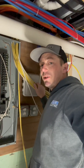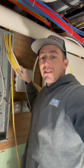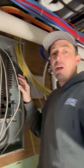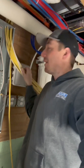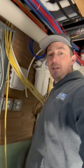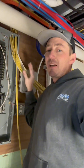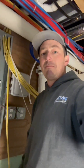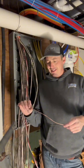Something you want to keep in mind when you're doing these panels: how your wires come into the panel also dictates how good your panel looks. If your wires coming in are all bent up and hard to deal with and not nice and smooth — unrolled nice and neatly — you're going to have problems making a nice panel. You want to have all those wires nice and smooth, not all bent up.